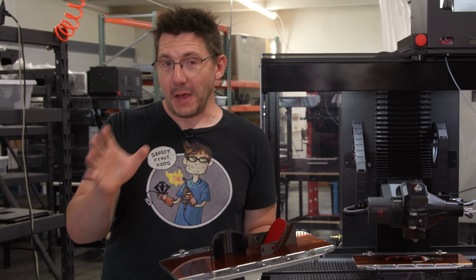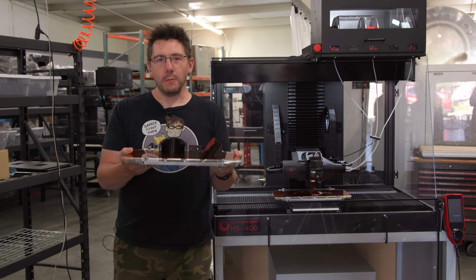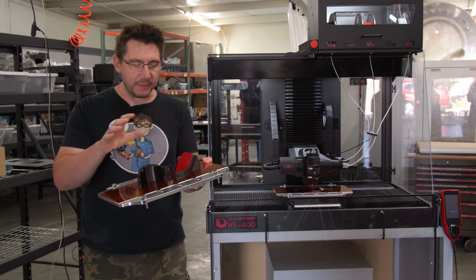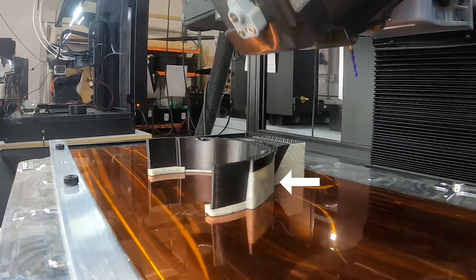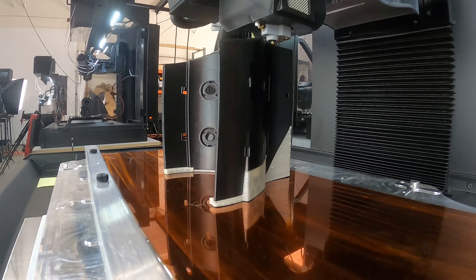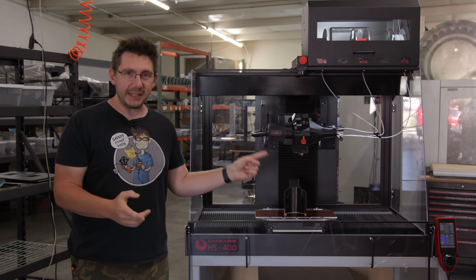Being that it has very expensive motion components on it, one of the beautiful parts of this machine are the build plates. You can remove them before taking the parts off. This also increases production because with multiple build plates, you don't have to wait for a part to come off one before you start the print of the next one. One of the main uses for multi-material systems is printing soluble support — a separate material that builds up and allows the bottom parts of the rigid materials or whatever you're printing to have a really nice finish. And this excels at that.